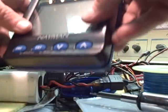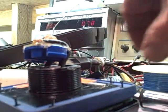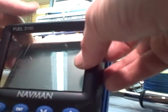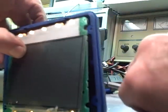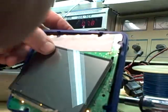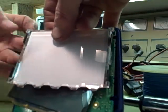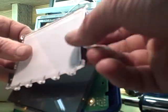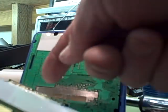what you have to do is take it apart with these eight screws and pull the two halves apart, pull the front bezel off. Then snap out the LCD on this corner here with the screwdriver. You snap that out and the LCD will come out, and the problem is the connection they used.